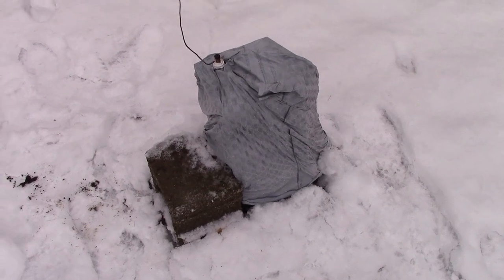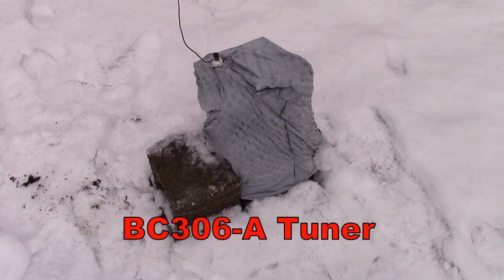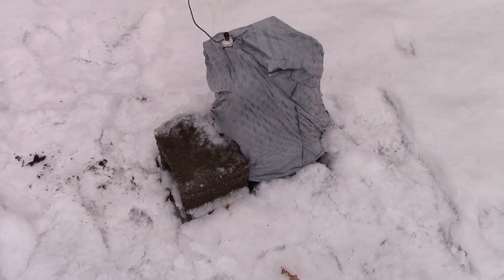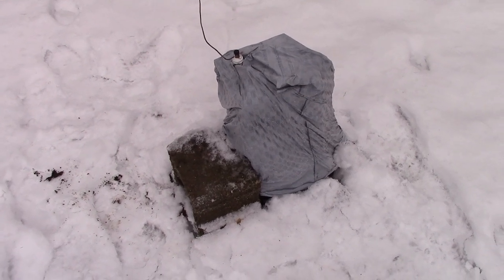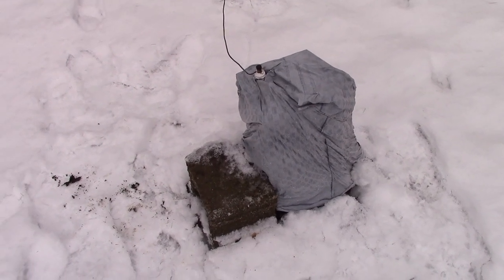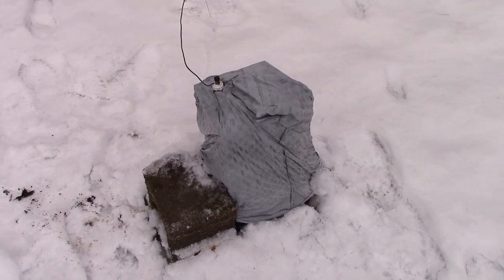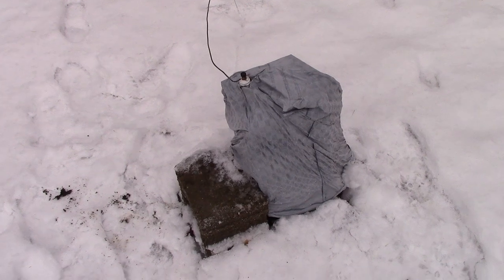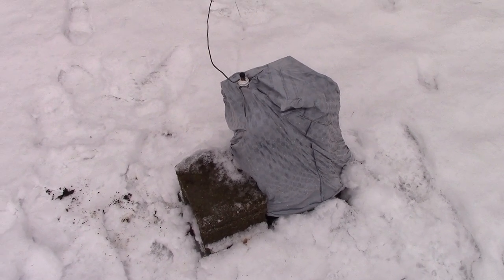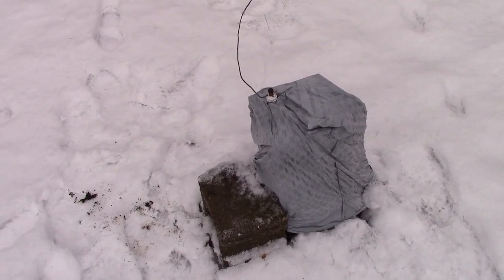This is just the experimental tuning box, and now we know why those guys have remote tuners or run antennas with a lower Q and a purposely less-than-perfect match. It might be better to adjust the antenna to 1.5 to 1 or 2 to 1 rather than a perfect match, simply because you don't have to tune as often — you make up the difference with just a little more power.